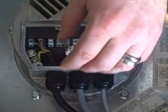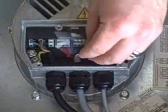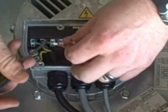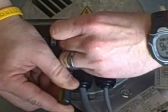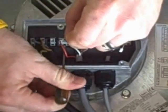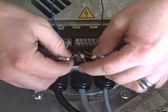Now we'll slowly start to wire in our potentiometer. If you don't use one of our Rosenberg potentiometers, your color coding and wiring will be different, so you'll have to go off the wiring diagram provided with the motor. First we'll wire up the alarm sensor — taking our red and white wires, one goes to normally closed and the other to normally open. Then take a jumper wire off the common line and go to one of the 24-volt plus controls. Now wire up the enable switch for this fan.